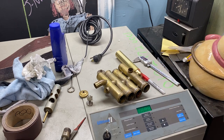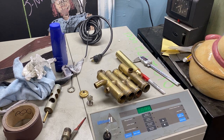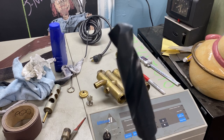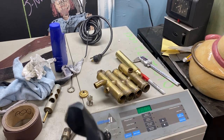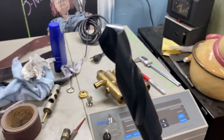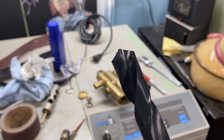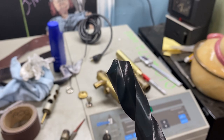Typically when you're doing holes like this in round things, you don't want to use a drill bit. You want to use an end mill or an annular cutter. The tubing I have to fit in here is such a weird size that if I was going to use an end mill, I'd have to come back with every hole and chase it with a boring head, which I don't feel like doing. So I found a drill bit that's the right size — it's like 20.5 millimeters, I think that's like 0.806, 0.808. It's a little undersized by a couple thousandths, but I'll scrape it out with a scraper to get the tubes to fit. We're going to brass off the tips so it doesn't bite in, and pilot drill every single one just to be extra sure.